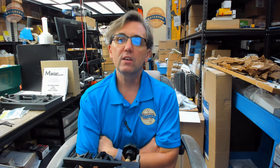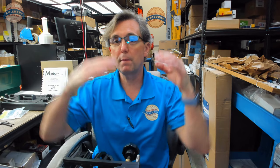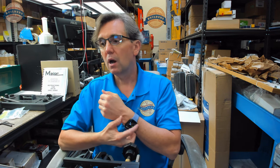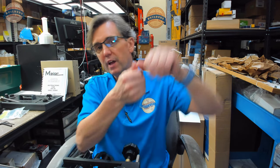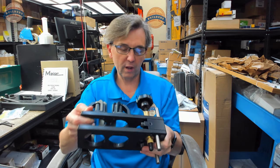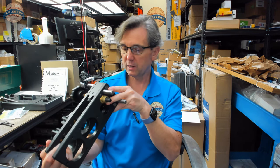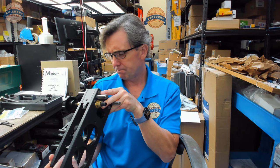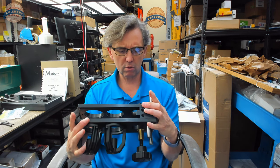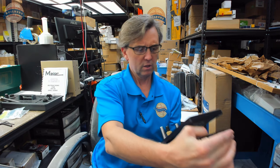The only thing that you really must be responsible for is making sure that you're prepping it at the proper height. If you're adding a deadbolt to a door, whether it's 4.5 inch, 6 inch, 7 11/16, who cares what the center to center is, for the most part, you just have to make sure that you're repeatable. So you'll have your dimension, you will strike a line on the work, and then you will place this. You know, I'd really have to think about what I would use as a point of reference on this to find my center line.